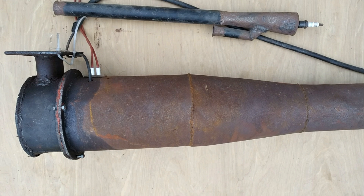The propane tank I was using didn't have a regulator and was opened all the way, and I've also seen videos of people running pulsejets of a similar size on just one tank, so this really shouldn't have been a fuel supply issue. Letting in a little more air by cutting some more holes in the head may help, but judging by how far it was from working, I don't think that would be enough. Another thing I've been thinking about is removing some more material from the valve, but again I don't think this would really be enough.